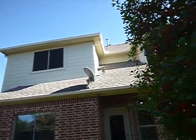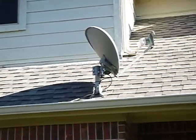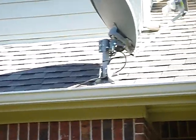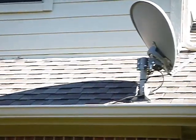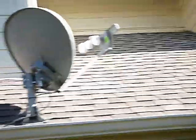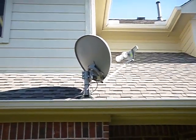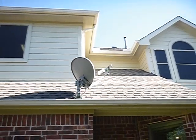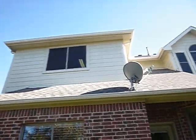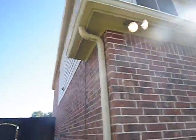Satellite dishes should not be installed directly to the roof covering. They sell a special little jig, a mounting bracket, if you will. The only place I've ever seen it is going to be in the illustration that I'm going to bake into the report. I got that from a roofing class more than 10 years ago. And I've never seen one. You'll never see one. But it's supposed to be there. So what's been seen can't be unseen.